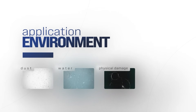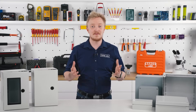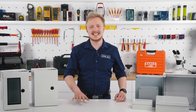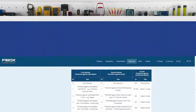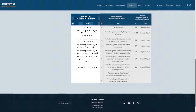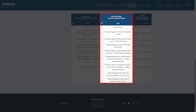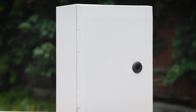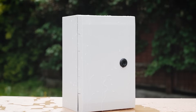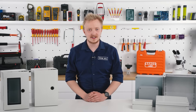There are four main factors we need to consider. First is the resistance to solid objects and particles, starting with holes that can fit your hands to tight sealing that won't let any dust through. This is determined by the first digit of the IP rating. Then there is waterproofness — the second digit tells you how wet the enclosure can get before it might become harmful for internal components. If you know it's going to be rainy and splashy, reach for at least six.